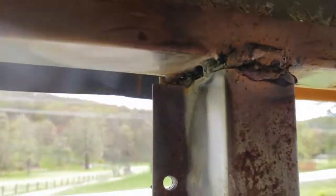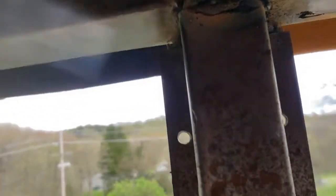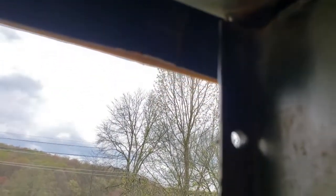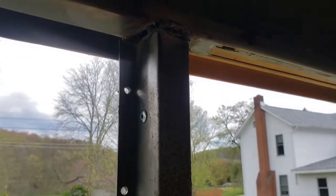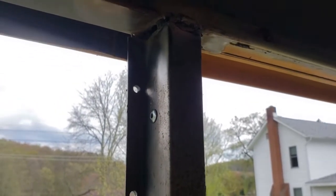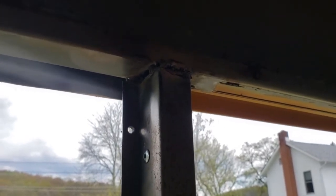I put a few ugly welds in around this. Now I'm going to cut two pieces of angle on either side. I've used the wire wheel to clean that up a little bit so I can weld. I'm going to tack those and rivet them in place to kind of support this structure from the sides, and then I'll hit it with some primer so that'll hold that hat channel in place. It'll act as the door hinge support so I just don't want the welds to break over time.